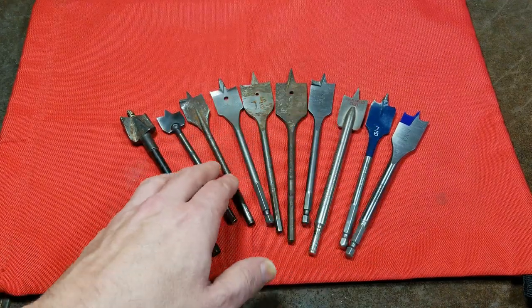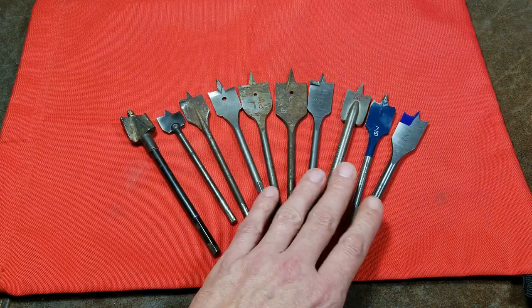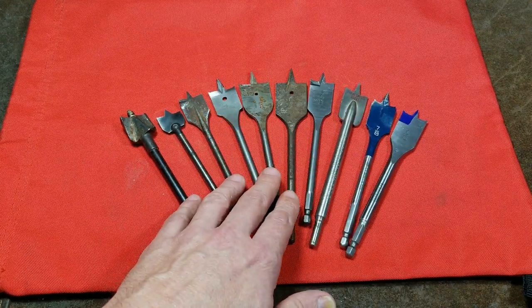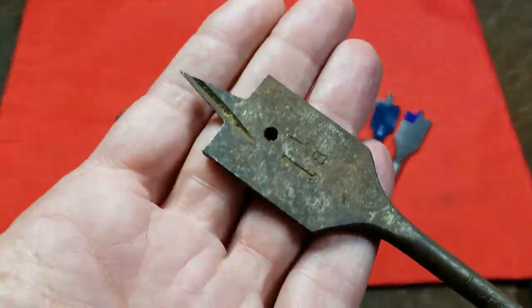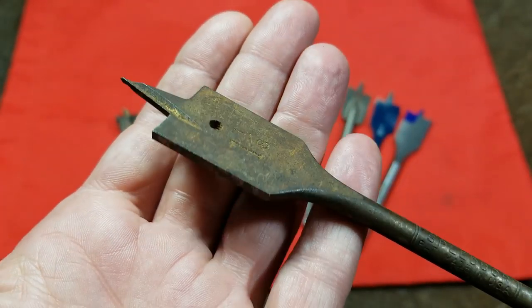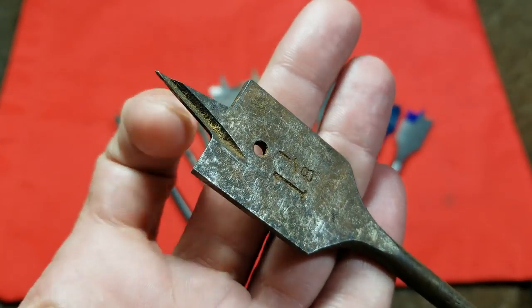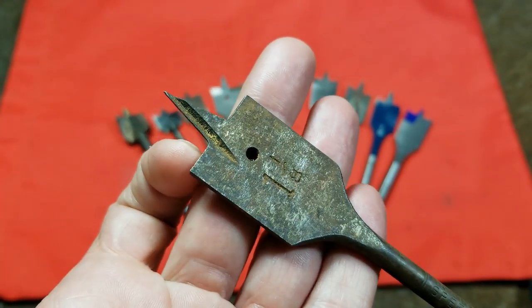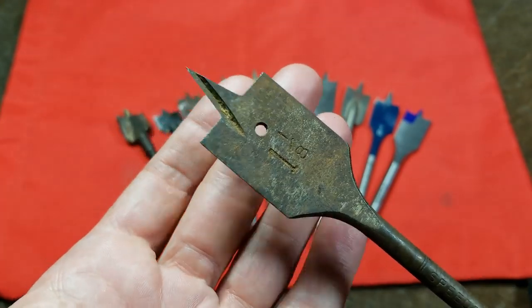This video is more of a tool aficionado video where I have 10 different ones that I've dug through in my collection. They all have slightly different geometries and how they've all tried to improve upon what would be the very basic design. This is literally just a piece of steel that's been rolled flat, had the two edges ground with just a little bit of a chamfer so it provides a cutting edge, and then an undercut so the tip provides some kind of a drill bit.